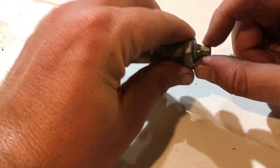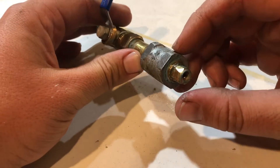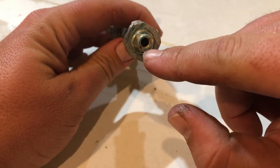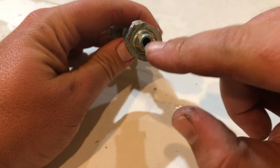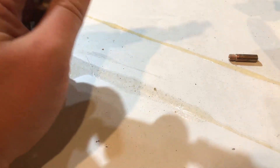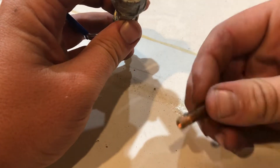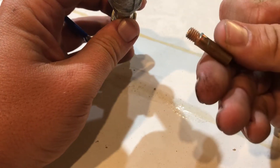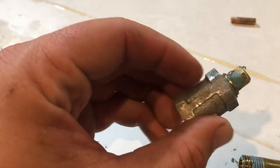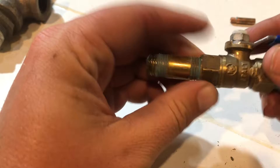After that we have a quarter-inch brass plug. The only machining you have to do to build this Venturi is drill and tap this plug with a number six drill bit. I bought a kit from a big-box store that had multiple sizes — you should get that one because it doesn't cost much more than just the number six on its own. Use it for the Magnum 100L spool gun MIG tip.